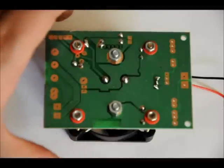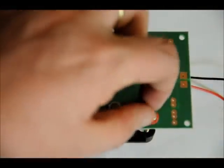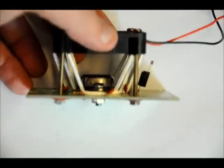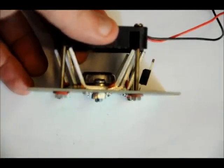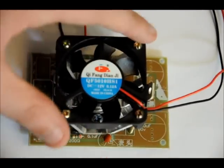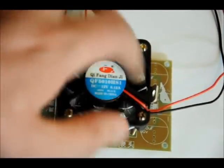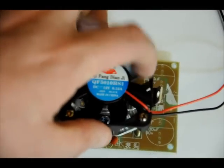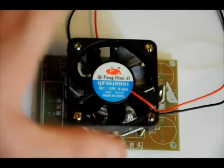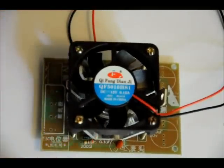Calibrate the top so that the fan is sitting properly and the fan blades are moving freely — that's when you can tighten. You don't need pliers; you can just hand tighten. Make sure that the heat sink blades are out far enough that they're seating the fan and not interfering with the fan blades. If those fan blades are not moving perfectly and you hear scraping, you're likely going to damage your fan blades. Be very careful that you've mounted this properly — it takes some fiddling, but once it's done it looks great.